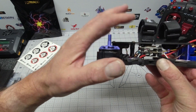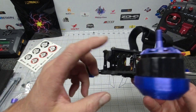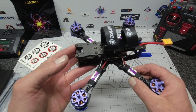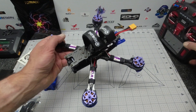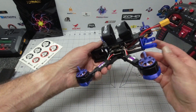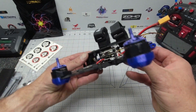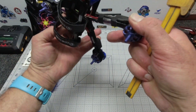There's a three-stack VTX. Talking about the VTX, we've gone from around 200 milliwatts in the version one up to 600 milliwatts, and it's running smart audio as well, which is pretty cool. There's USB-C for Betaflight. You can buy this by itself or with a radio included. You'll still need goggles, but if you already have your radio it's just a matter of purchasing one of these X220s and getting it in the sky. This is the receiverless version so I need to put on my TBS Crossfire. They've also provided a nice TBS mount on the rear where the VTX antenna lives.